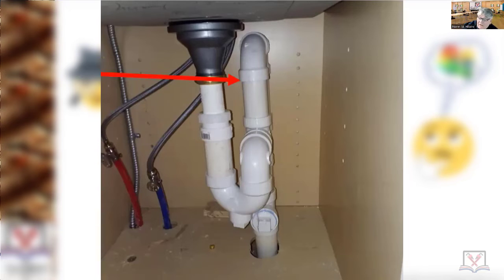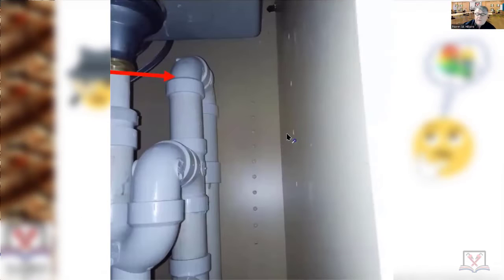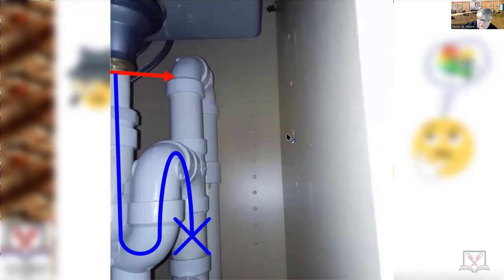And now you have no vent because the drain is going down the vent. All the water is draining down the vent because we have a stoppage — could be a partial stoppage, could be a complete stoppage, whatever the case may be. Stoppage right here, water coming down, hits the stoppage, and can't get down that way, so it goes down the vent. Nobody will ever know.